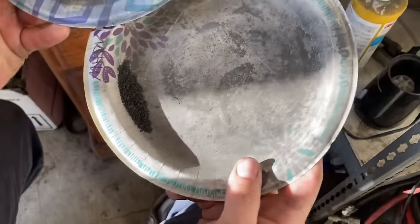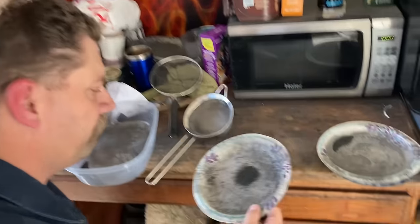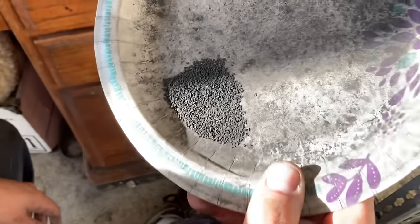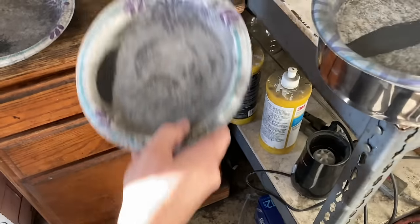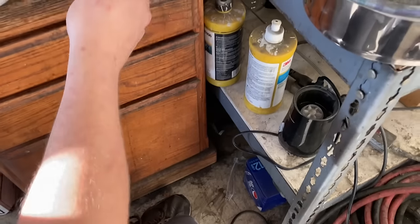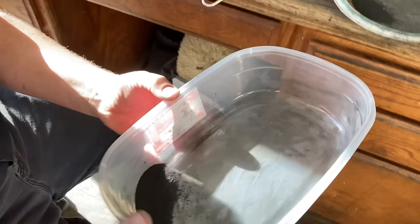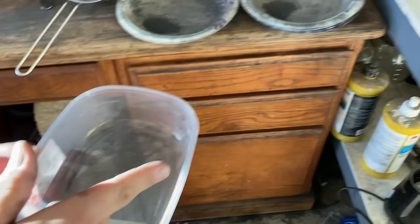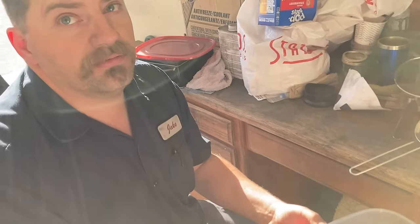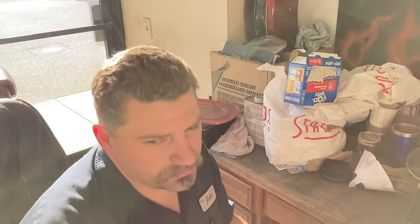Those right there are a little bit bigger — you could put them in there and run them through the machine again to try and get a little bit more uniform. Right there is 2F, and this here is closer to 1F. But we have ours set up to where we get mostly 3F. You'll get less dust if you have bigger granules. The tighter the machine is, the smaller your granules are, and the more dust you'll get.